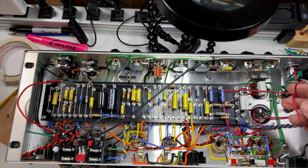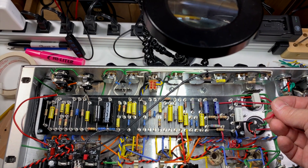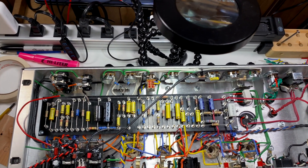The other thing I have not connected is the secondaries for the power transformer. I need to check the voltage coming out of those first before I hook it up to the amp. You will see all of that as I go through.